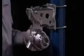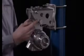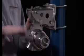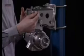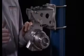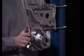Okay, we've completed the installation of our receiver onto our alignment mount. I'd like to briefly point out your adjustment points here. The 2 big bolts on the bottom are what we use to adjust our vertical, or up and down, aiming. And then the 2 horizontal bolts on top are used to adjust your horizontal, or side-to-side, aiming. At this point, it's a good idea to give your receiver a rough alignment and make sure it's generally pointed downfield at your transmitter. That's going to make that final alignment step just a little bit easier.